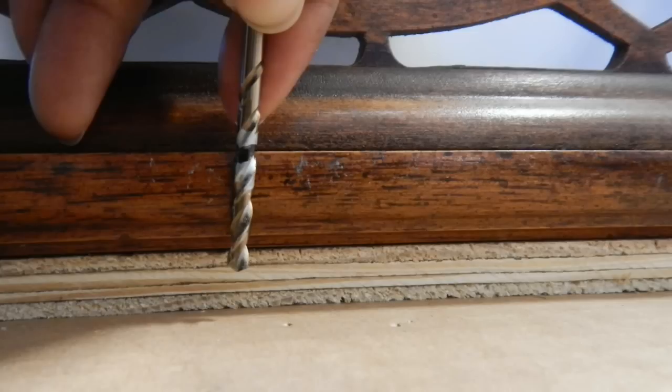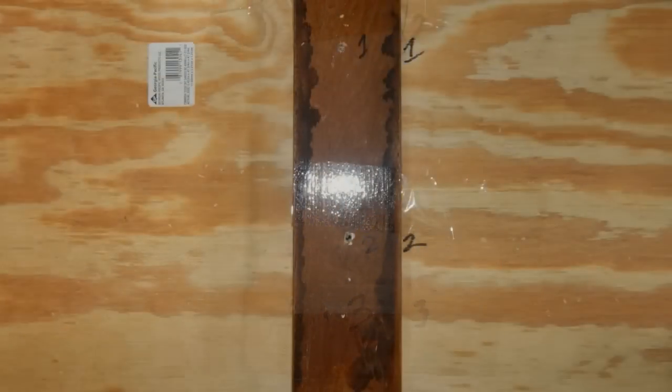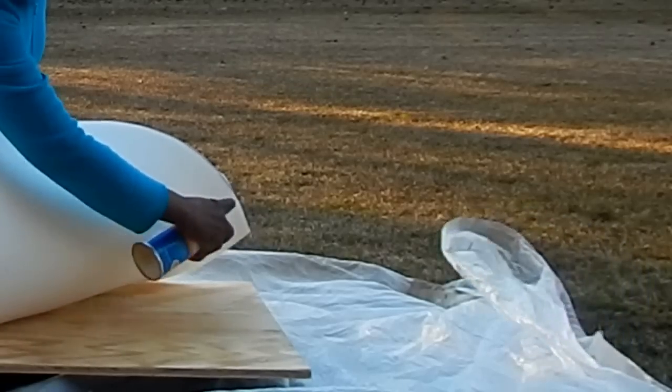I used my Sharpie to get the marking and headed to Lowe's to buy the screws — and yes, I took the drill bit with me to match it. Using my mark as a guide, I pre-drilled all 13 holes into the table. I'm using numbers to help me properly align the board to the table after the upholstery is done. I traced around the edge of the board with a Sharpie, leaving about a half-inch gap on all four sides. Always apply spray adhesive and any paints in a well-ventilated area — it was a little cold, but I got it done.